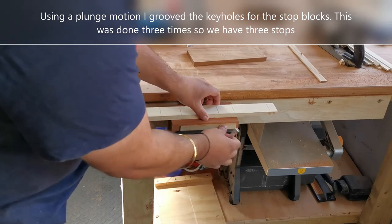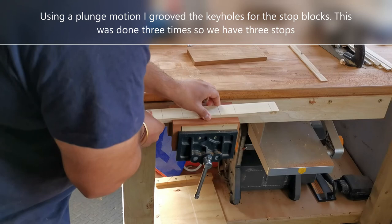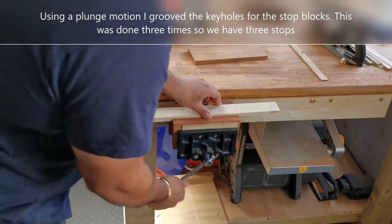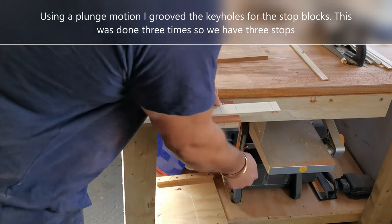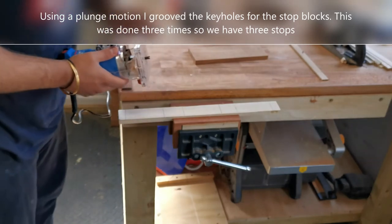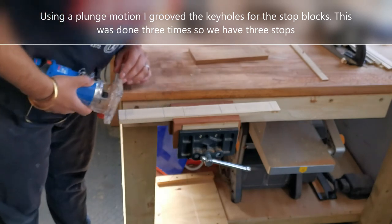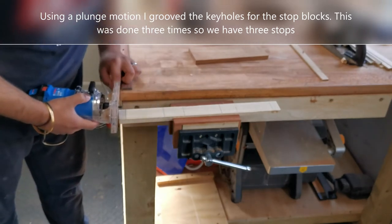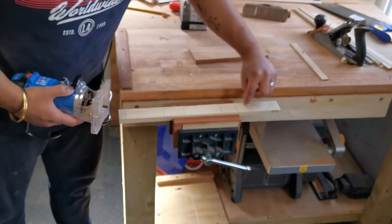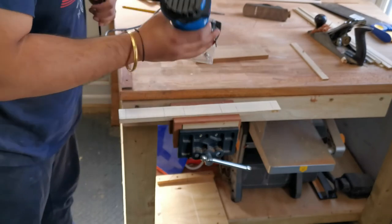I'm placing this into the vise to hold it in place. This won't be the final thickness of the timber, but to make my life easier I'll use the vise to hold the piece and use the side of my bench to guide the distance between the bit and the fence. It'll be offset just on the edge, which should be perfect, so I can cut them to the right width to fit inside the groove on the jigs.